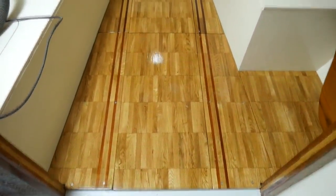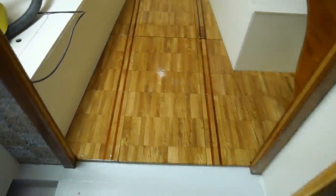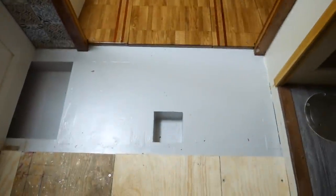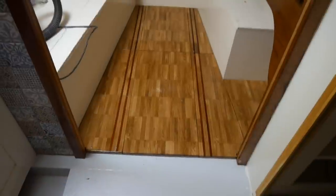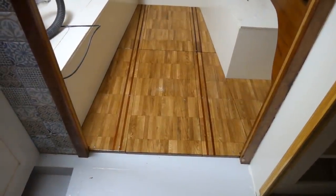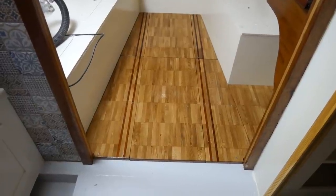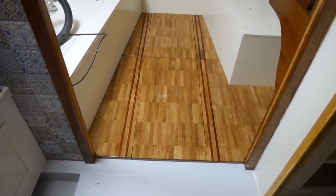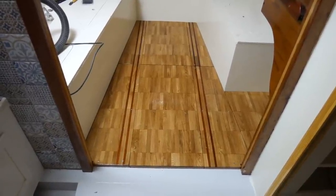And then if I spin around, those two there, one, two, between the mahogany stripes, will be lift out. So the area here by the mast step will be just fixed permanently. So we'll have three lift out boards down the center. I've got those brass finger ring things to put in there to make the lifting out easier. Coming on, and I dare say at some stage I'll put some retaining straps under those boards for ocean sailing.